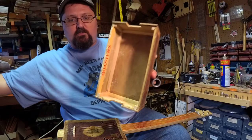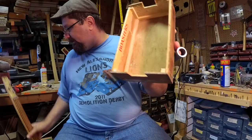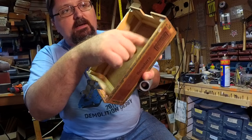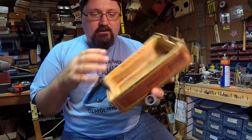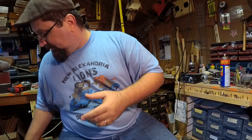What I also did with these was take little pieces of 3/8-inch wood and put that down on the inside, making little bracings all glued in there to keep the box nice and solid. Anytime I'm working with antique boxes, I do a lot of extra bracing.